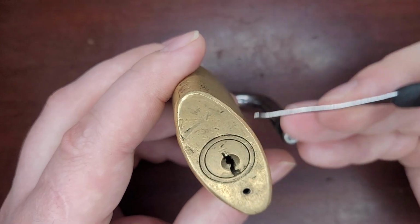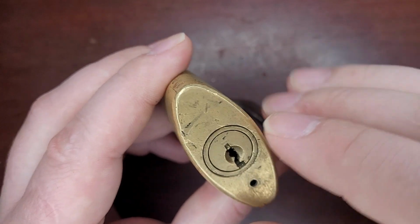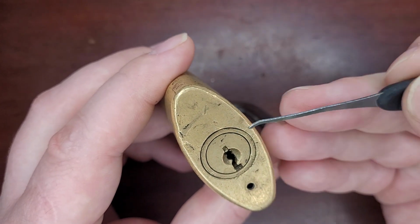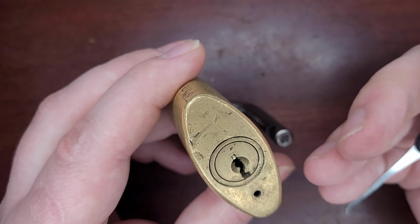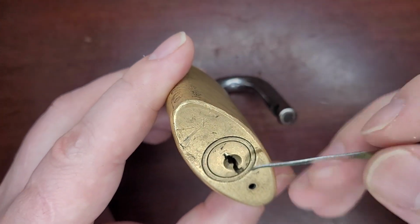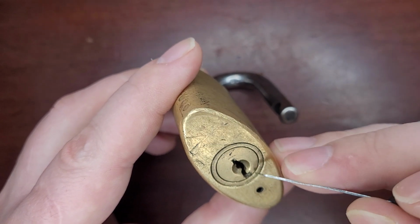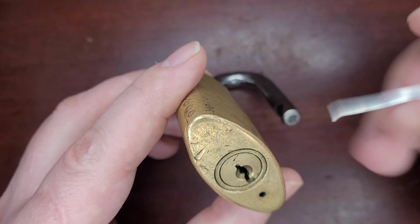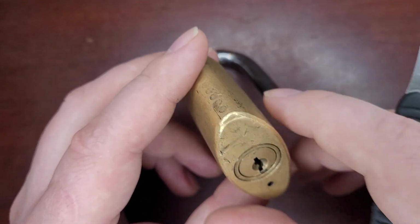I'm assuming that maybe this washer is actually manufactured in a cone shape, and that when they press the plug in, they press it down with that washer and it spreads out in some sort of cavity or milling around the sides here, and then it retains the plug. But that's a lot of guessing. I'm really not 100% sure. I was able to spin the ring 360 with the pick, just sort of digging in and pushing it, and I didn't see any sort of cuts or notches or anything like that in it, which is why I think it might have been pressed in from the front.